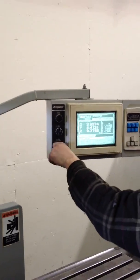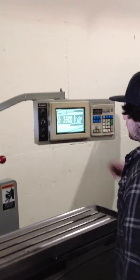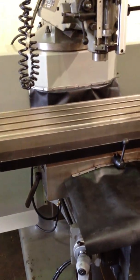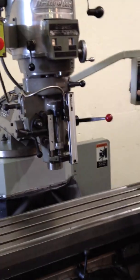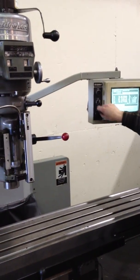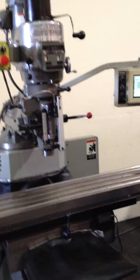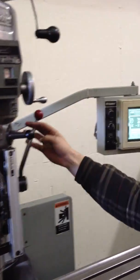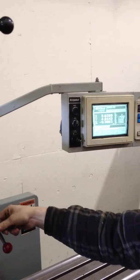You can also use the hand wheel when you turn the servo off. That's the Y axis, and again the hand wheel and pulse generator. You can also change the position of the Z axis quill, and it'll change on the DRO — it'll act as a DRO on the screen.